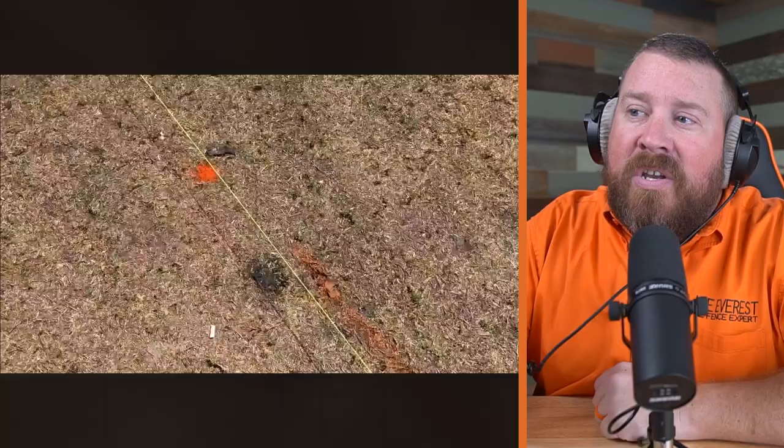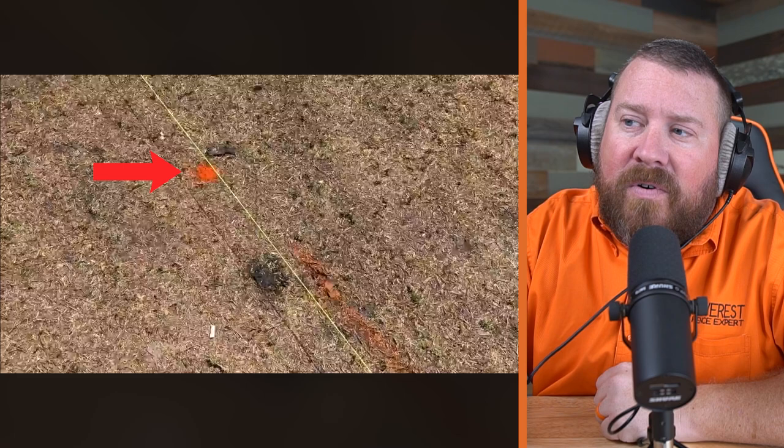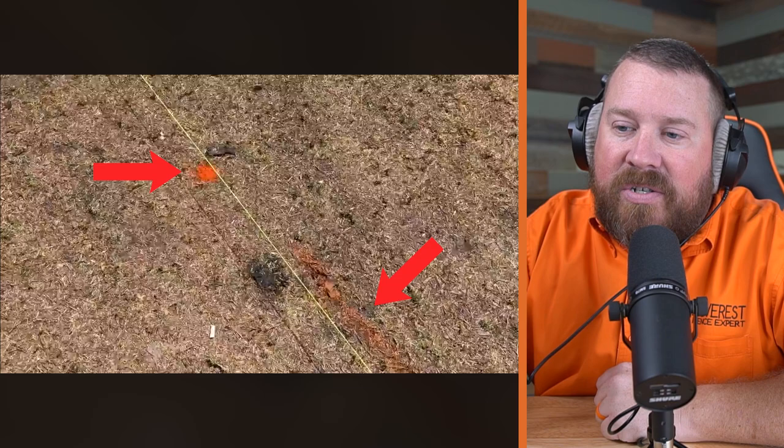So this kind of illustrates why this is dangerous using colored paint. So he's using orange paint, but what we just saw get panned over was an orange marking, a utility marking. Orange denotes communication. So it can be anything from coax to telephone, 2-pair, 4-pair, whatever. But it can also be fiber optic. Fiber optic's used for communication. So it would be really easy if you're using bright orange to lay out your fence line, but there's also bright orange utility lines right in line with this fence, it might be easy to confuse the two.